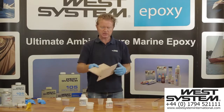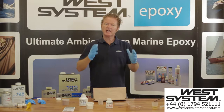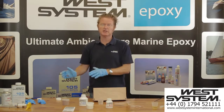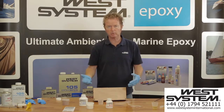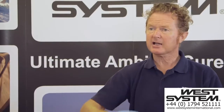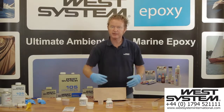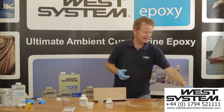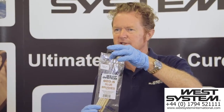For more advanced techniques, we would really advocate best practice, a technique that we refer to as two-step bonding. Two-step bonding is very simple. We prime a porous surface with the West System resin and hardener mix and let that wick into the plywood before then creating a fillet. Now, to do that with our mini pack, we really need to purchase some West System glue brushes.